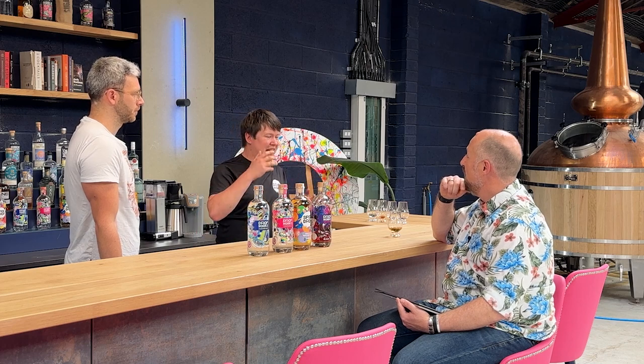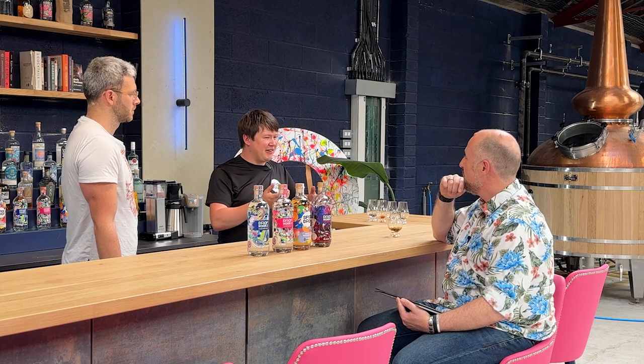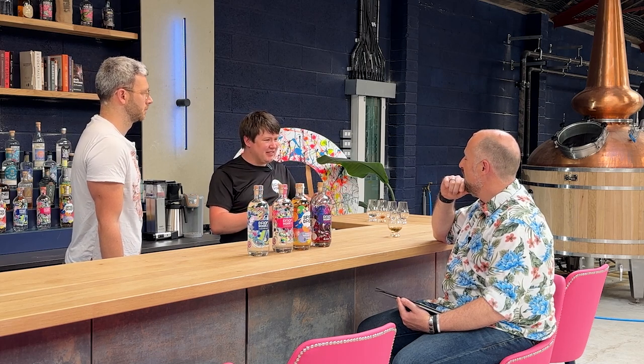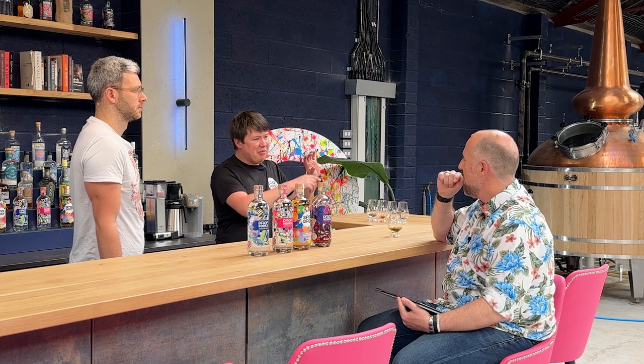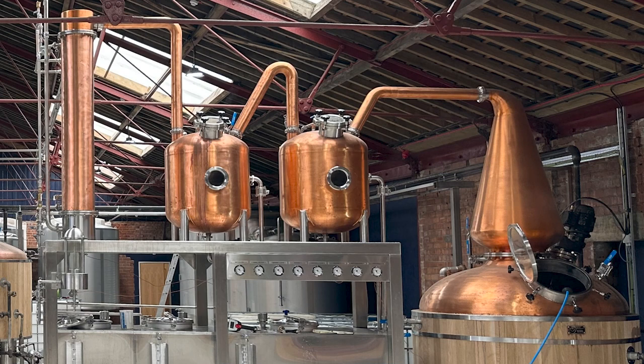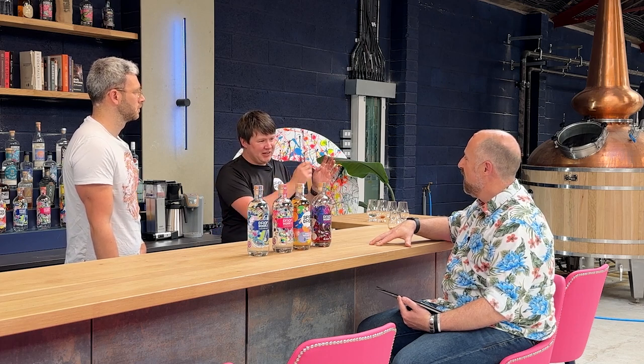So it comes out of the pot, and it'll probably be 50% first thing in the morning. It then dives into a whole load of liquid, and our still is about 20%. Obviously, that's higher than the percentage in the pot, so it actually gains more strength. It then passes over into the next retort, where it usually is like 45-50%, bubbles away and vaporizes again and comes out first thing in the morning, like 82%. So you step up the ABV as it goes from pot to retort and then out.